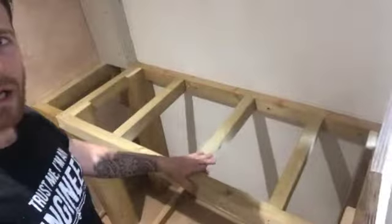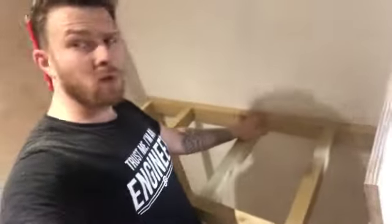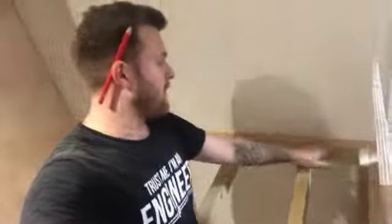Guys, quick top tip. I've now braced out the top of the frame. I'm ready for the top to go on, which is now cut. This here isn't perfect, there are imperfections in it, so you wouldn't want to screw your ply straight to this. With the best will in the world, you try to get it perfect, but there's still a few bits where it's not quite flat.